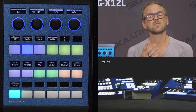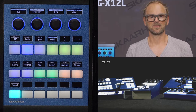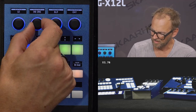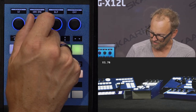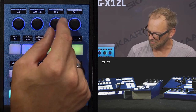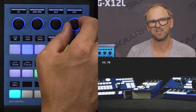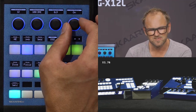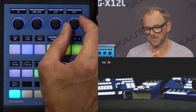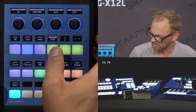Going back to manual and then to the levels menu, you see some detailed scientific features. You can set the black level, and you can set the white level in precise values from 90 IRE up to 108 IRE on this knob. There's gamma mode giving control over image output, and then lens shading, which compensates for light falloff in the corners of the image — you can see the effect when adjusting this.